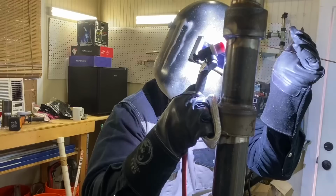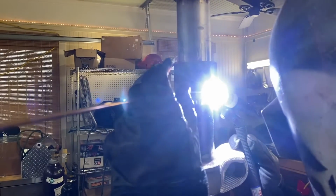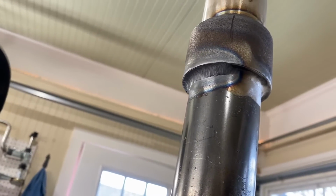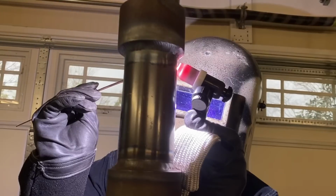going to do 3. If we were feeding just a little bit extra in here or even going up to a 5/32 filler, could probably have done it in 2. But sometimes they want them all the way out to the lip and then some practically. So we're doing 3 passes. And just know you gotta go with the flow on the job site you're on. If you got an inspector that demands it be taken all the way out to the lip and with a convex weld, then that's kind of what you have to do. But just know that sometimes it can be done in 2.